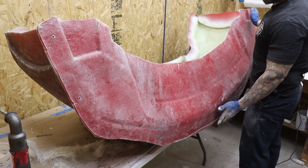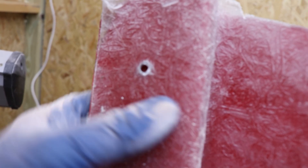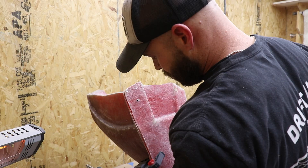That will create a unique problem — our bolt holes do not line up. They are still very off; it looks as though you can barely see through that one. I think the only option is to clamp the outside to keep it tight. I think this is caused by the shrink of the fiberglass, because fiberglass obviously shrinks. Let's make this work — we will test this out, the clamp stays strong.